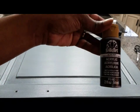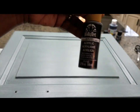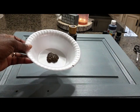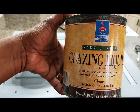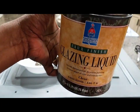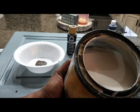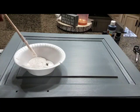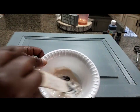What I'm going to do here is use a glaze and mix it with just a little bit of hobby paint from Hobby Lobby. The color I'm using is raw umber. I'm going to mix it with a glaze medium — I just have a little bit of paint in the bowl, and you use the same amount if not more glaze to mix it together. I got this glaze from the ReStore, but it is from Sherwin-Williams and it retails for about $15 or more, so don't forget to go to the ReStore. The color looks creamy white, but when you mix it with the paint it does not change the color of the paint at all. What the glaze does is help extend the working time of your paint.